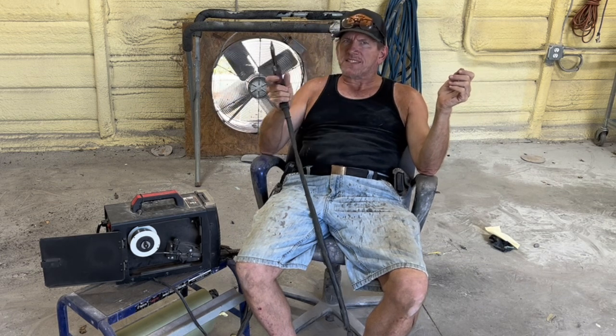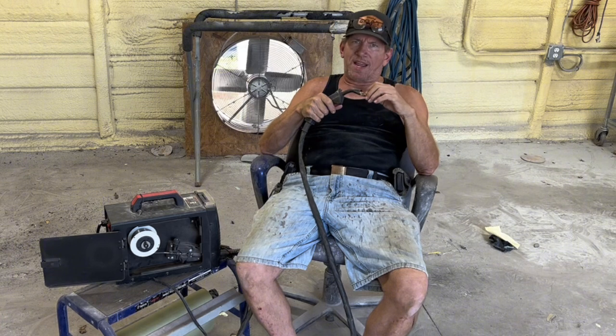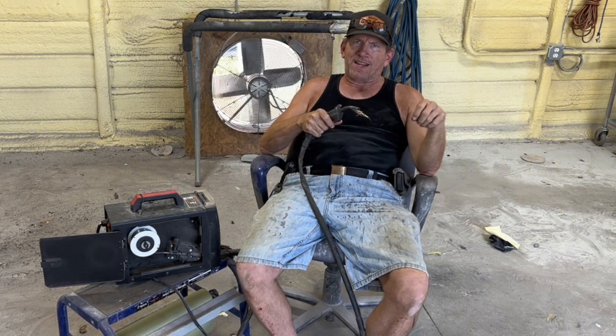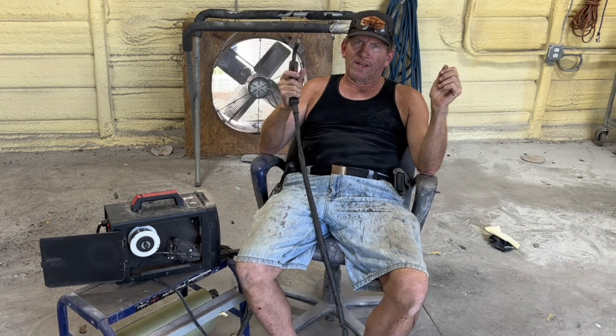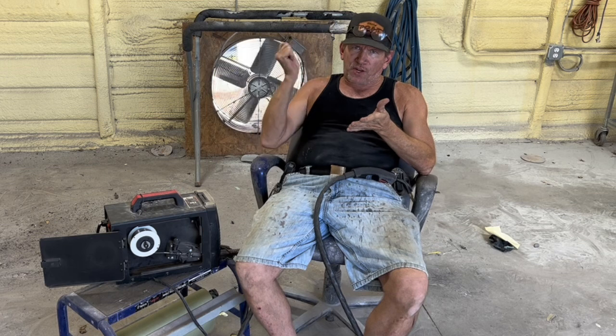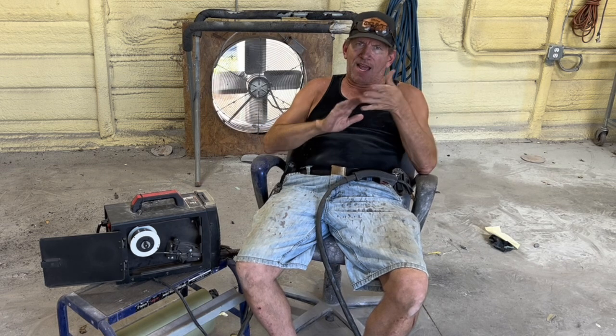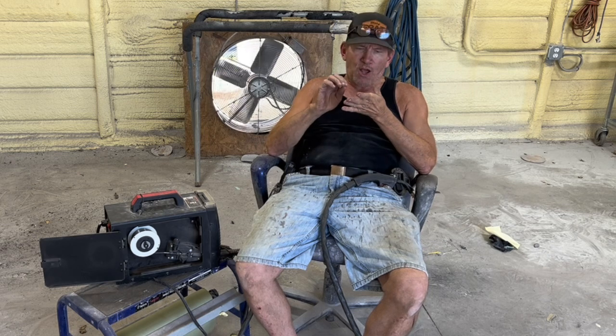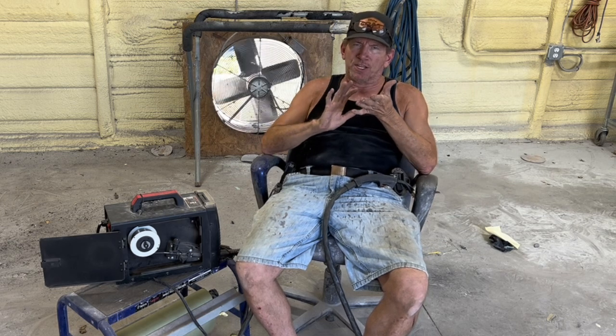And the best thing about that flux core weld is there wasn't gas coming onto it and cooling it while you were welding and making it harder. That flux core weld is more malleable, better for hammer and dolly, flatten it out and things like that. More able to compress the molecules in there because it's not been over-hardened by a cooling gas on top of it.